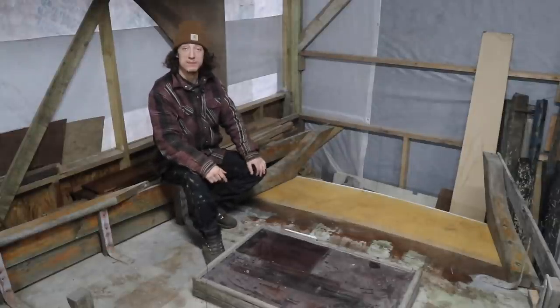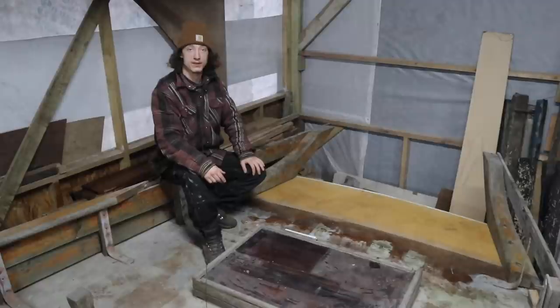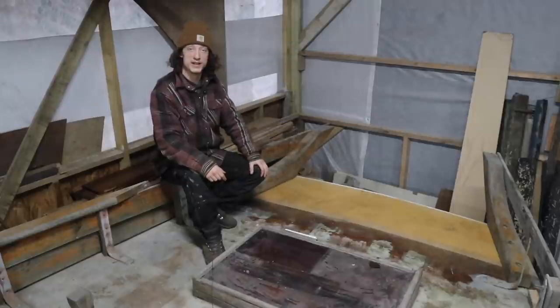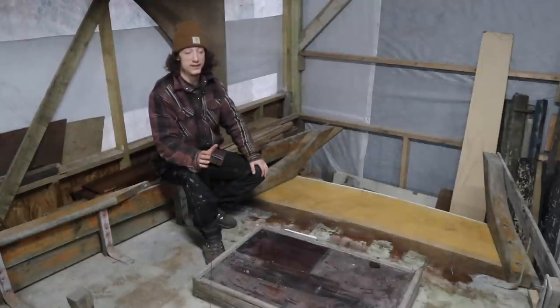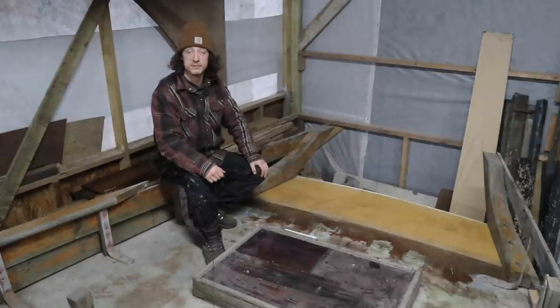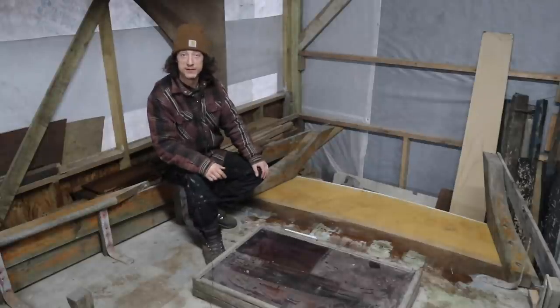So I've now got to get my steaming kit set up and then start selecting and machining the timbers I need to steam bend and laminate up these transom knees. But first things first, I need to make a template of the new knee, and then I also need to make a former in which I can bend the steam bent timbers round. So let's get this template made.